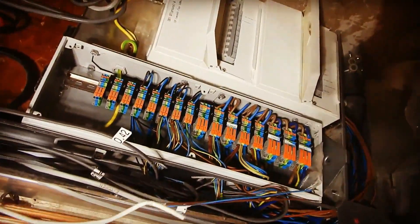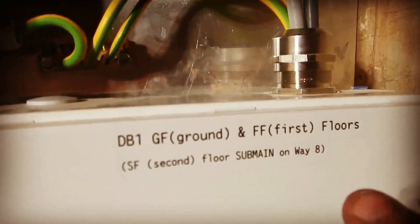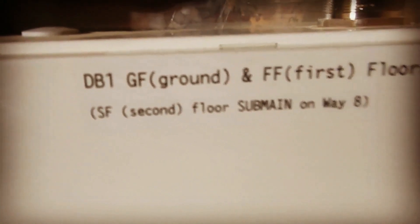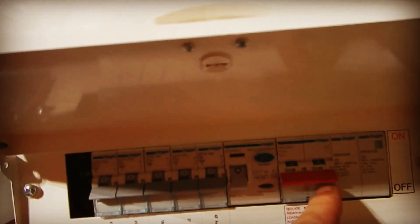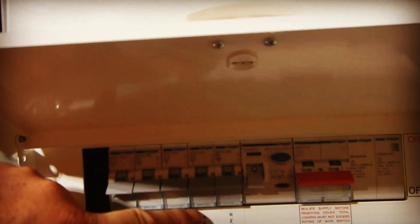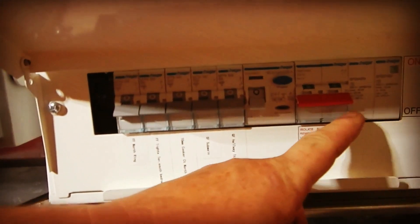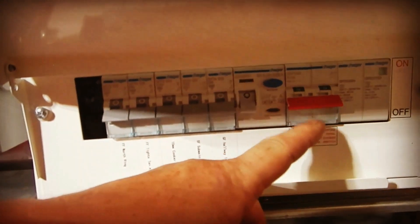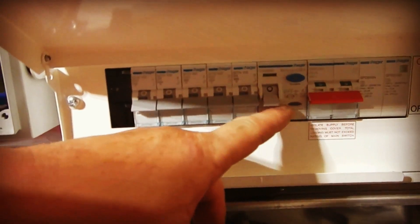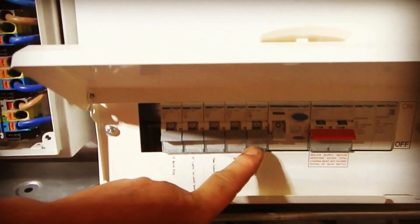I've started labelling the ones I've connected: DB1 ground and first floors, second floor sub-main on way 8. The way I count it - I don't know if any of you do anything different - I count this as way 1, 2, 3, 4, 5, 6, 7, 8 second floor sub-main. The reason is that in the general scheme of test results you need to put down where the surge protective device is, main switch, RCD1 - so if I put 1 through 6 for those, the first circuit is on way 7, which tidies up the general scheme of test results quite a lot.